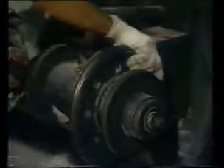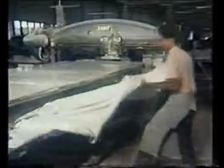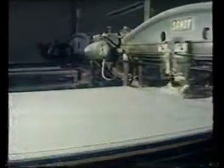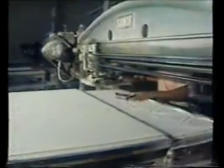and correct tension of textile are required. The material is then carefully laid down on the cutting table, ready for cutting into the different boot components. The components are cut using clicking knives.